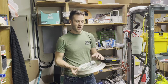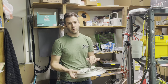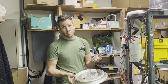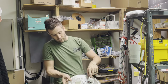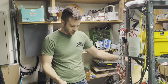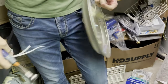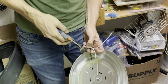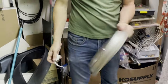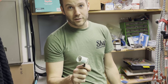We're in our camp storage room finding a way to put lights inside the beer fixture. In the apartment business we have a lot of people that break globes on lights — these Project Source lights from Lowe's are pretty cheap and we've had to pull some globes for other units, so we're left with a few extra bases. You can buy light sockets fairly cheap, but since we've got these laying around we'll use them. There's a little clip underneath that holds them on — disengage that to remove the socket from the fixture, get rid of the insulation on the back, and clip each set of wires with wire cutters.